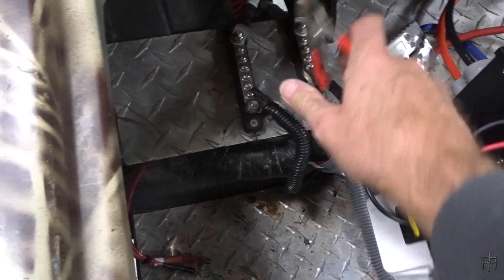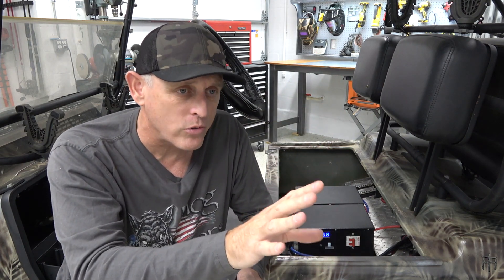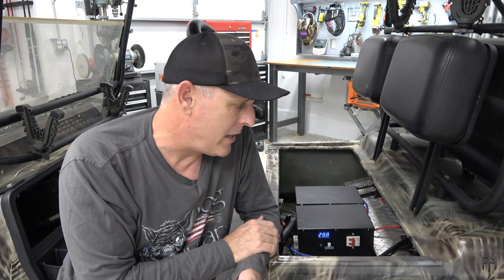The second choice — which is what I decided to go with — is to create a jig like this: you take your higher voltage box, connect it to your 12 volt bus bar, turn your lights on, and drain that battery down to equal the lower voltage box. Then you plug your main charger back into both packs and bring both batteries up to fully charged equally. It's the easiest and cheapest way to do it, but the slowest. It took me all night to drain from about 29-something volts down to 25.5 volts running a backlight and a front light.